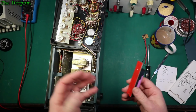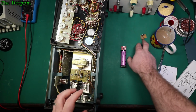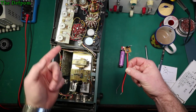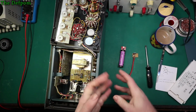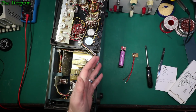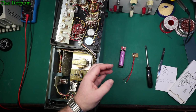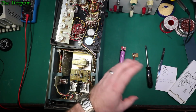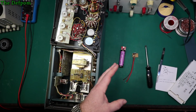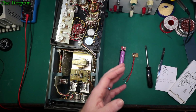Now, the first thought I had when that battery issue came to light was that I could just chuck a voltage regulator in, like I could just put this in, wire that into the circuitry, running off one of the other battery packs, and done. Right? Don't have to worry about having another battery in there. Well, I was looking into the circuit diagrams for that, and it's a completely isolated battery circuit. And I think, well, they must have done it that way for a reason. That battery just goes to one thing, and that is it. There's no other ground references which are shared, nothing like that. It's completely isolated.